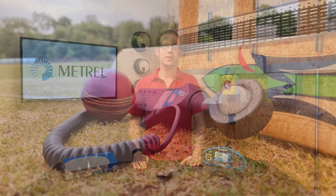Once you've found the lowest value along that centre line, you could also use the lux meter to make sure that the highest value along it isn't over 40 times the lowest — which is also a requirement for emergency lighting.